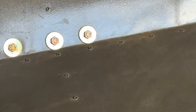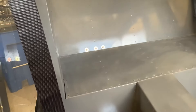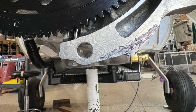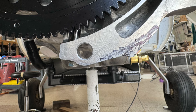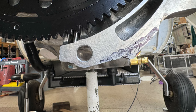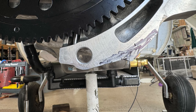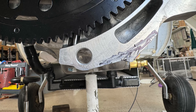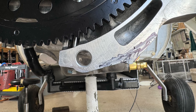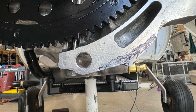There's a little detail we missed — the three bolts that hold the header tank front bracket. When you start fitting the cowling, make sure the little bell housing areas — the things that protrude, especially on the pilot side — are not hitting the cowlings. That makes it really hard; you think you've got the bottom cowling in the right place, but it might not pull up because it's hitting this. You can just use a porta-band or a jigsaw with a fine blade and just trim this off.